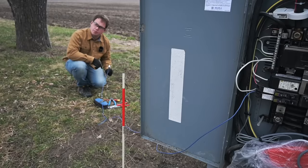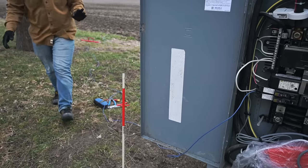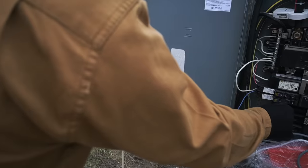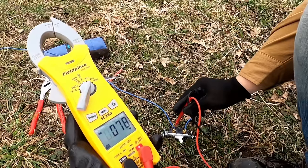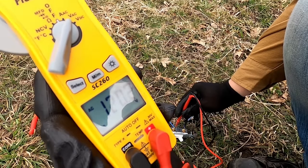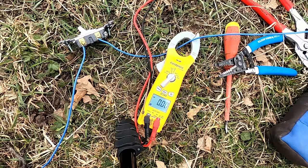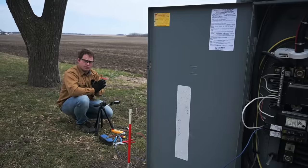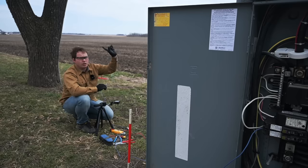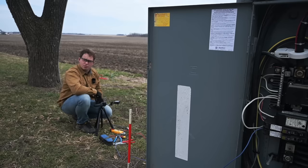I'm going to make sure our switch is in the off position, which it is right now, so it shouldn't trip right away when we turn on the breaker. I'm going to turn on the breaker and then trip it by turning the switch itself on. Let me check across these terminals to make sure we have 120 volts — which we do, 120.3 volts across those two terminals. We have our ammeter clamped around the wire so we'll be able to monitor how many amps are drawn. Most likely it's probably just going to trip right away. If you guys want to predict what's going to happen — do you think this breaker is going to trip or not trip?